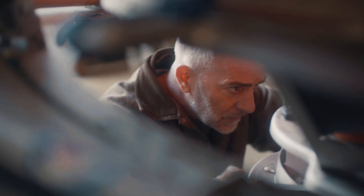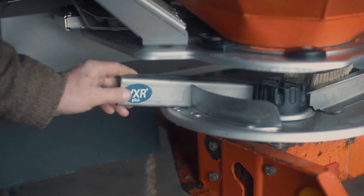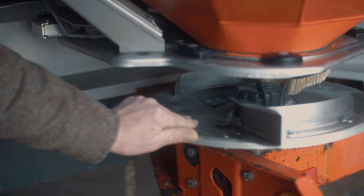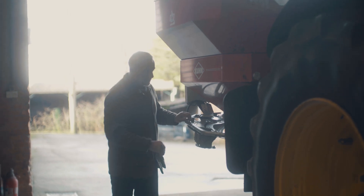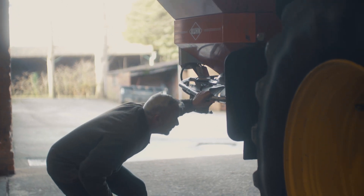Make sure you regularly check your spreader for any wear and tear, as this will affect the spread pattern. If you do see anything in particular, make sure you get some parts changed from your manufacturer. Make sure all the vanes on the spreader aren't damaged or worn down — you need everything to be in good working order to make sure it's going to throw out that good spread pattern for an even application.